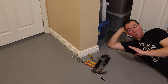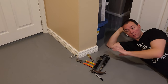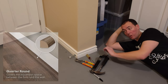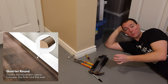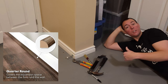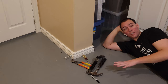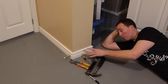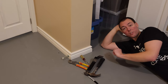There are two schools of thought when it comes to doing the edging around laminate flooring. One, you can go ahead and just leave everything as it is and install a piece of three-quarter round around the outside to cover up your expansion gaps, because you are going to have a little bit of space between the wall and the edge of your piece for expansion and contraction through the summer, the humidity — it's going to move. The other approach, which is what I'm going to be doing, is to take off all of my trim because my trim is actually relatively thick at the bottom — about three-quarters of an inch thick.